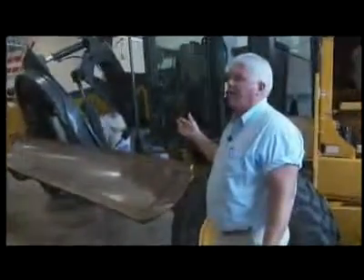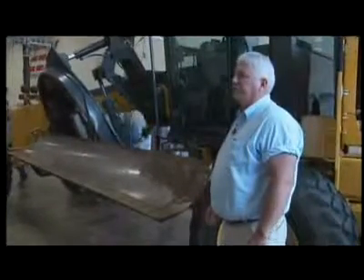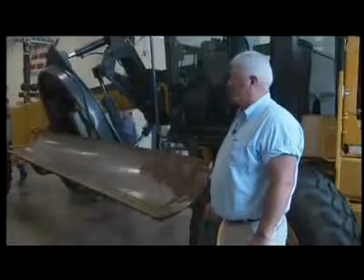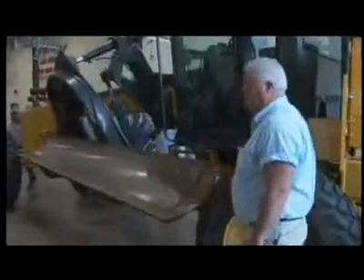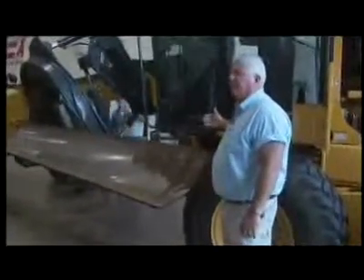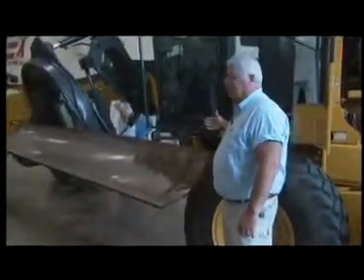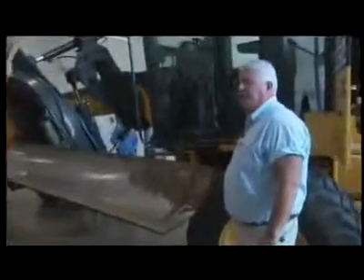It's always best advised if you're going to be milling around your machine, it's better to do it before you start the machine. All these motor graders articulate. They have the secondary steering capability to frame steer, and when they're running, these clearances between the cab and the front of the tandems really close right up. There's just not enough room in there for a person to fit in between and you can have problems right away.